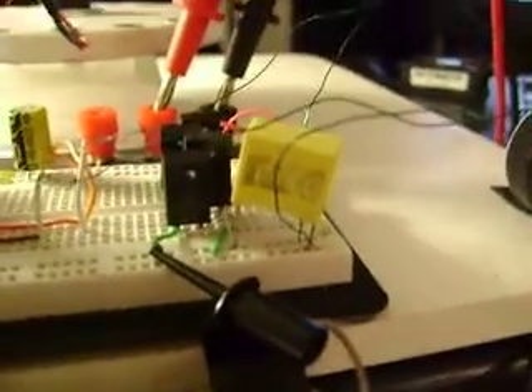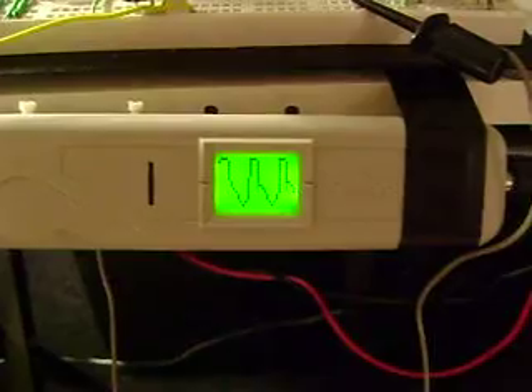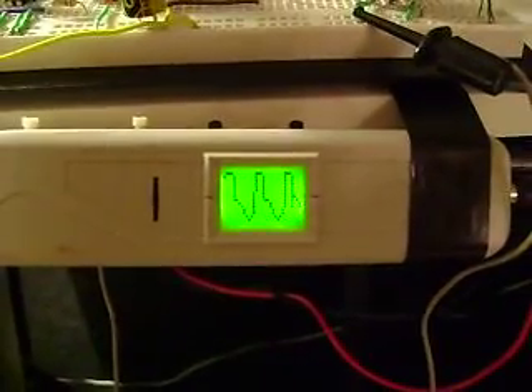It seems a little jumpy since I took out that resistor, probably because of the fan. But see this capacitor? I put that across the output coil — it's a 0.33 microfarad. You can see the voltage is 4.9. Now I'll pull this out — she jumps down, and the waveform turns a lot cleaner without the cap, which is the strange thing. When I put it back in, there's a little more pulsing. I guess it's becoming a resonant circuit and whatever ringing is happening, I'm able to collect that ring at this particular resonance.